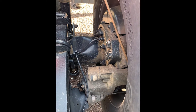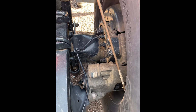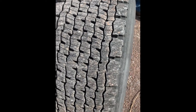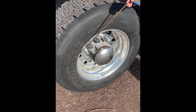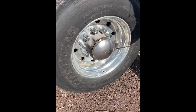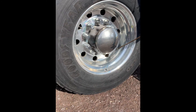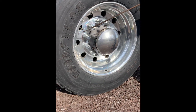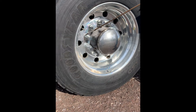The inside of our wheel, securely mounted, no extra holes or welds. The inside of our wheel is securely seated to the inside of our tire. There's no abrasions, bulges, or cuts in the inside of our tire. The surface of our tire is worn evenly with a minimum of 2/32nds of an inch of tread depth. The outside of my tire, securely seated to the outside of my rim. The rim itself, securely mounted, no extra holes or welds drilled in the rim. All of my lug nuts are securely mounted with no rust trails indicating a loose lug nut. My hub seal, securely mounted, not bent, broken, or cracked, does not appear to be leaking anywhere. My valve stem, securely mounted, not bent, broken, or cracked — that's where I would check the tire pressure and inflate the tire.